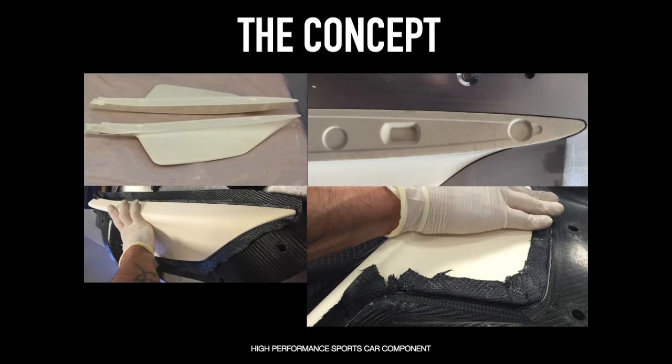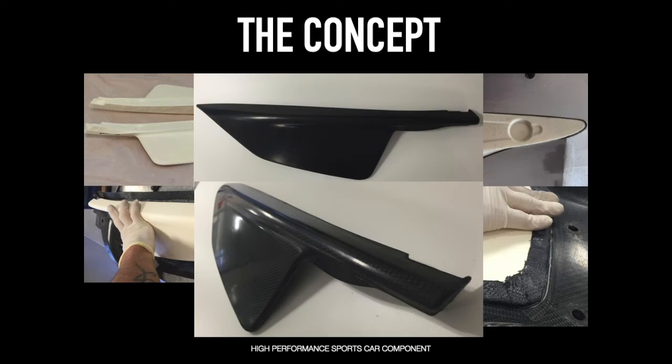Interferences and imperfections of the lay-up preparation are managed by the viscosity and active expansion of the core, compacting the lay-up from the closure of the mould.